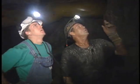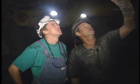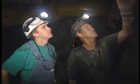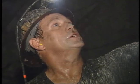Now the reason we bolted like we did here, if you notice there's a kind of a fault that runs up behind. Well, that's the reason I tried to get two bolts right at the edge of that, and that'll hold it up to where it can't keep eating out as it goes across. See, the rest of the ground is all keyed in to that slip. Once you catch that slip, like I was telling you before, you always want to go through a slip if you possibly can, and it'll catch it, and then the rest of it's pretty secure. You'll have a bolting pattern that they recommend, and it might be like four across, but if you see a fault like here, we could have said, well, we only want four bolts across, so we put 1, 2, 3, 4. Well, that would not support that fault. Yeah. I've never had a supervisor or anybody ever bitch about you putting in one or two extra bolts to secure the ground. You always want to make it safe for you.